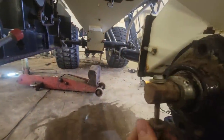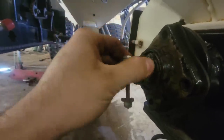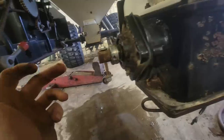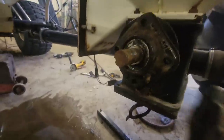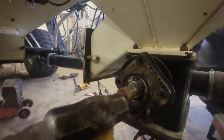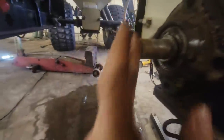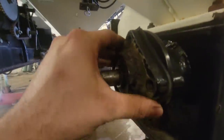I need to get a 7/16ths and undo that. I got this lock collar unlocked and I've got this end all apart, so I'm hoping I can emery cloth this real nice and start tapping it and everything will work its way out. There we go, got that apart — started to give her a few little tippy taps and she's going, but I don't like just hitting it like that because I'm going to mushroom it all out, so we'll get something softer to continue tapping with.